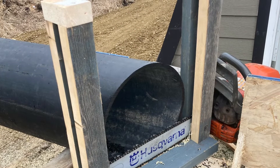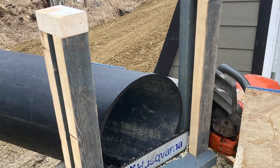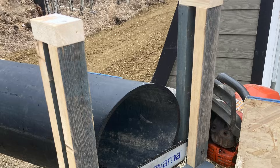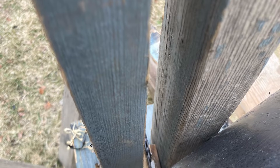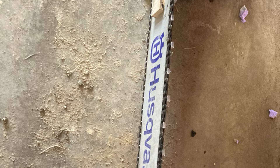I had the idea and the plans more or less in my head already — pretty simple and straightforward. I did up some drawings on the computer. The first challenge was cutting the pipe, mitering the angles to the right angles, square and clean. We ended up using a chainsaw and rigged up a miter box. The first one got chewed up by the chainsaw, so we ended up gluing blocks to the chainsaw bar to save the miter box, and it actually worked pretty good in the end.